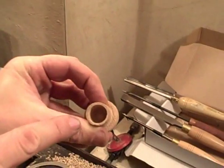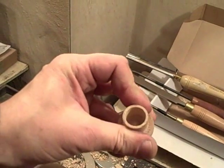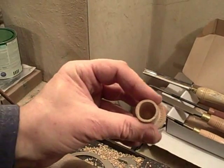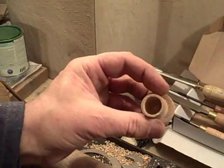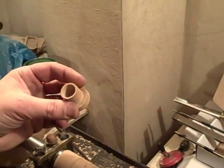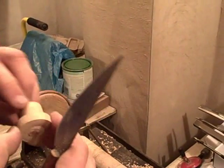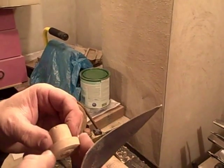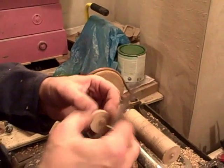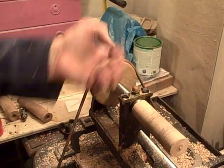I could have left a longer nib in there, which they did do, but you just put your skew chisel into the left there and you dig in from there instead of from the centre — I prefer to drive it in from the centre. I said skew chisel again, didn't I? But no, it's a spindle gouge. There's a little bit of a knot there — I think that's going to be okay. When I put that in the oil that I dip it in three times at the end, that will be absolutely fine. So, that's my lid completed.